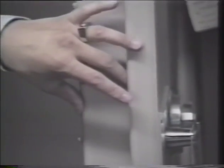As I explained to you about a fireproof safe, the major reason for the existence of the safe is to dissipate heat, to keep it under 350 degrees, to preserve paper contents. This, if you look at it, has a 1/4 inch steel outside shell, which means practically anything can drill through it. And of course, the thickness of this is really to contain the insulation or the solidified waters, as we talked about in the previous cutaway safe.